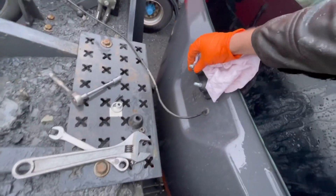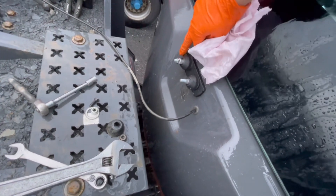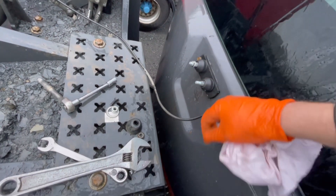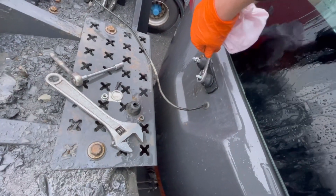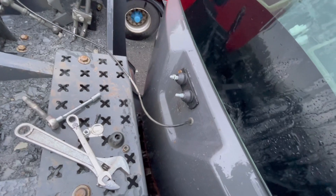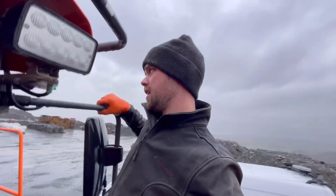So you've got this plate with a sort of dummy spindle — that's for the second part of the arm, it just spins on a bearing in this plate. You've got an M6 bolt that goes through into the back of the wiper motor. You push the motor through, but the motor just wants to sit down. My top tip is to run the locking nut on and then with your spanner you can turn the wiper motor up until all your holes are lined up, run that bolt in, then run the big nut on and tighten everything up. The first time I did that I really struggled because your arms aren't long enough to reach around into the cabin — I was forced to use my brain. Right, let's get the wiper arm on and then I'm finished with the outside work.